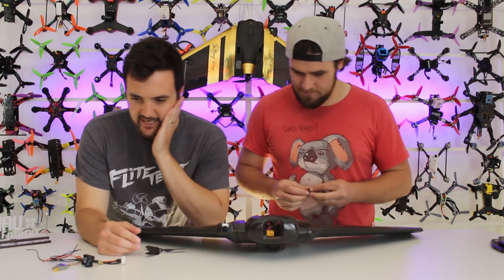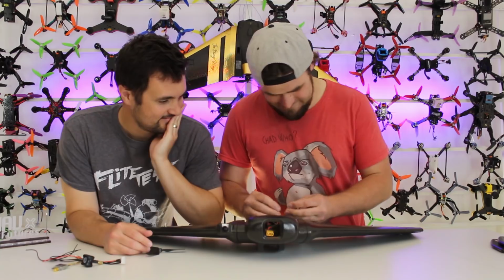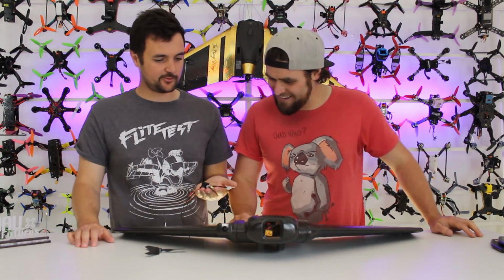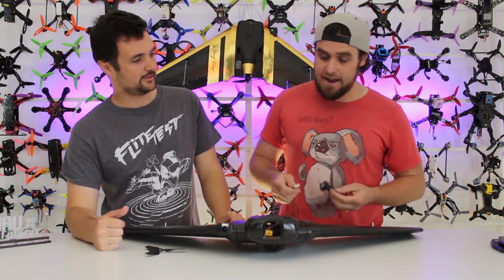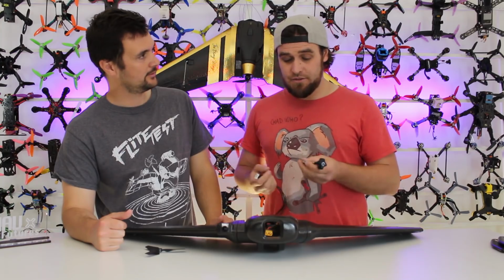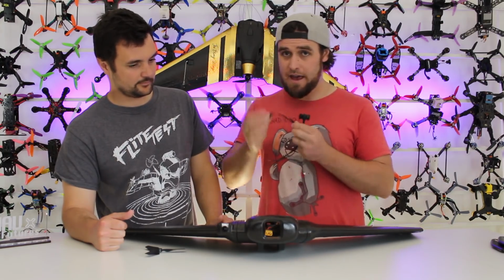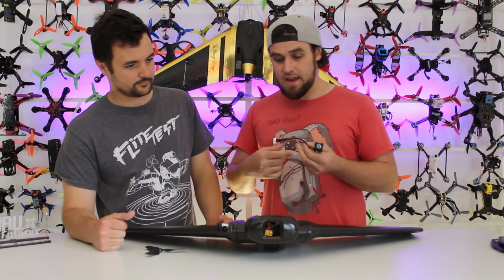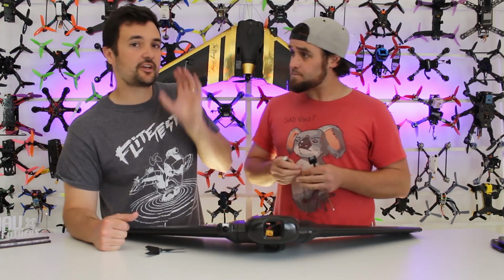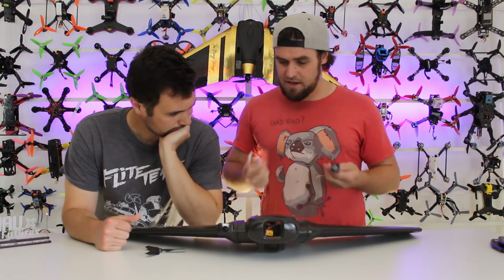All right. So if you want to put that in, and then I'm amazed how simple this is. These are the things we've got left. This is what you put out on the bench for me and said that's what we need to work with. So basically what we need to be doing now is setting up our FPV kit. That's going to require us to do a little bit of soldering, just to join the video wires, and we're going to be soldering up a special little power harness for the kit, so the FPV is isolated from the servos and stuff like that. And that's important too, so you don't get any noise coming into your video. That's basically just going to clean up the video feed, keep it noise free. It's going to make it really nice flying.